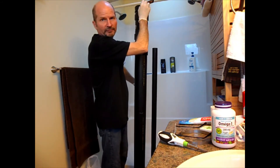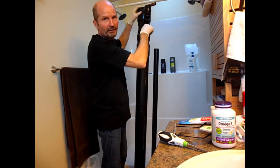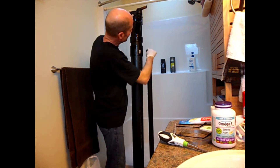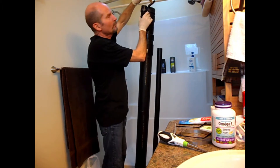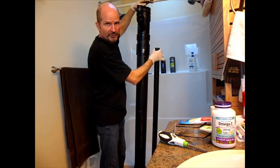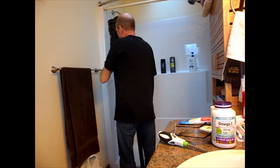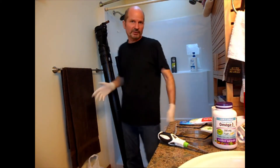The shower water passes over your body for about five seconds then goes straight down to the sewer. There's no other feed into this pipe, just this one shower. So whenever anybody has a shower, hot drain water comes in, fills up the pipe, and goes back to the drain. Cold water comes in, pre-warmed water goes to the hot water tank. In theory, the water leaving this pipe to the sewer drain should be cold — this copper pipe should extract all the heat out of the wastewater. And it works pretty well.